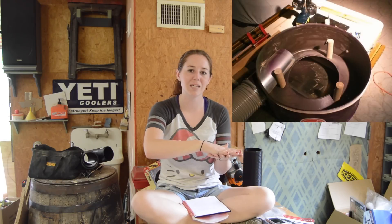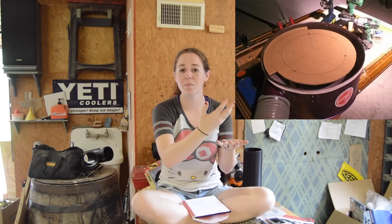You don't have to convert your one-stage into a two-stage. One gentleman bought the Harbor Freight unit and set it up right out of the box, but he wasn't happy because in the lower bag portion where all the dust is collected, it would swirl around every time he turned the unit on. So he made a fine baffle and inserted it directly into the collector itself, which solved the problem of the dust wanting to come back out of the bag. This is still a one-stage dust collector, but with a fine baffle incorporated to solve that problem.